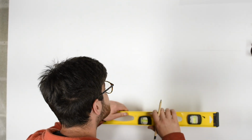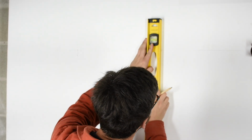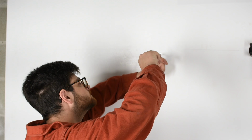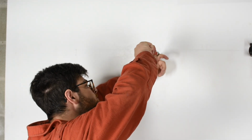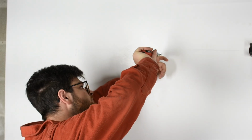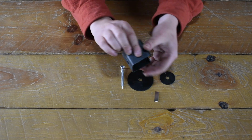5 studs. Here I'm going to find that mark on our first stud, and approximately 1 inch below that mark I'm going to mark another hole, and this is where the number 3 screw will be installed. And I'm going to fasten it into the wall, making sure that it's flush with the drywall surface.